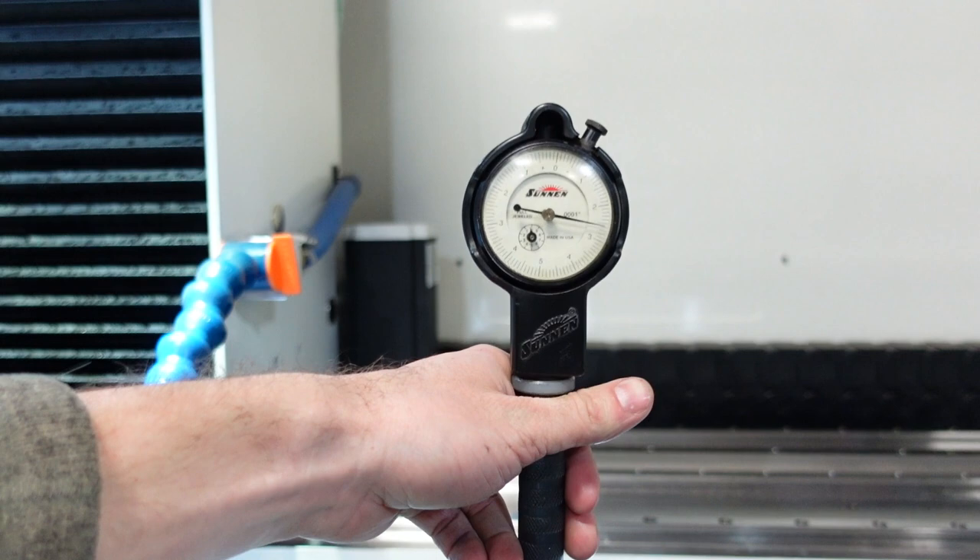I can hear that my Rotler is done machining back here — let's go check it out. Yep, cycle complete. Right now we're just roughing, so I rough it three thousandths to size and then I'll come back and finish it. Look at this — at the very top of the bore I'm three thousandths from size, go to the very bottom — 3.1 thousandths. It's within one ten-thousandth.